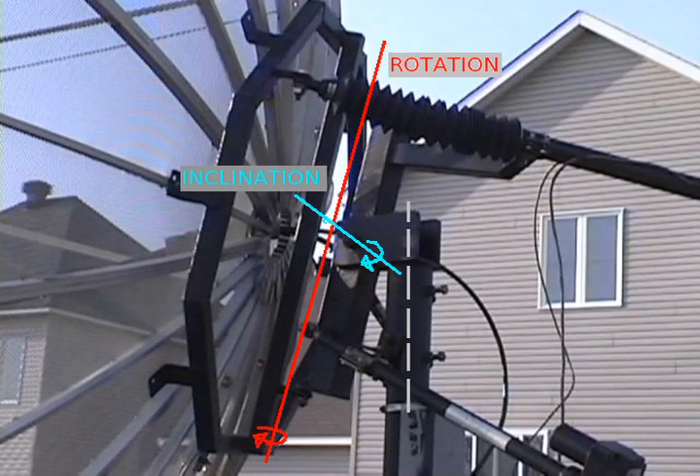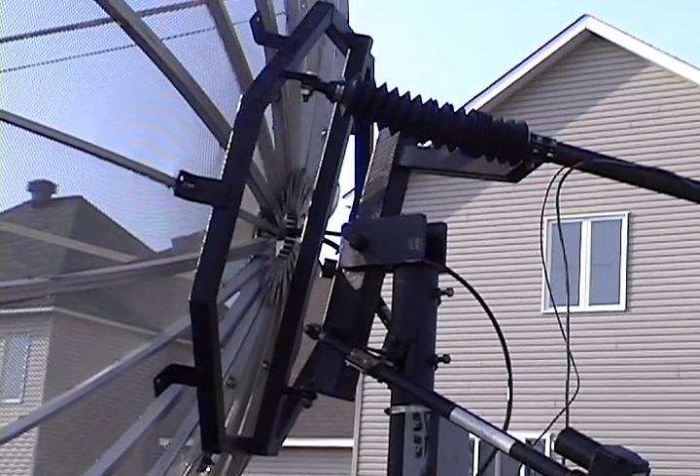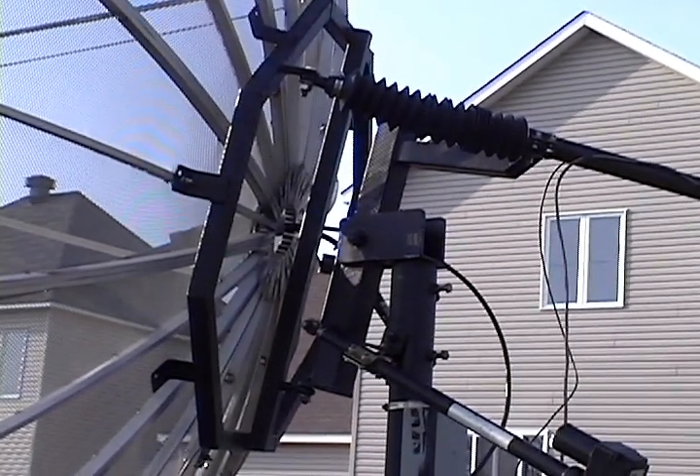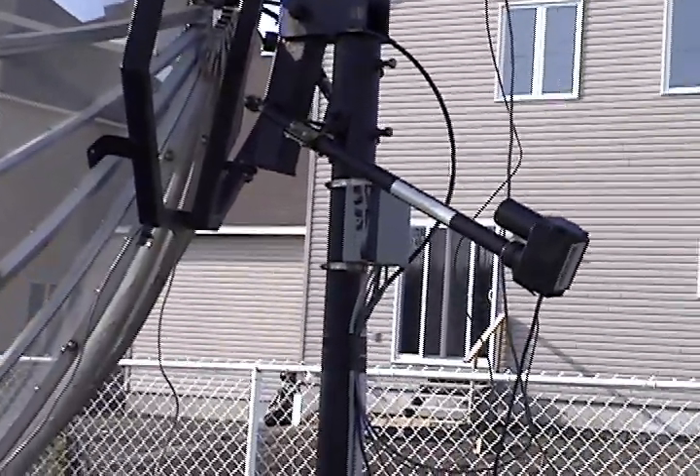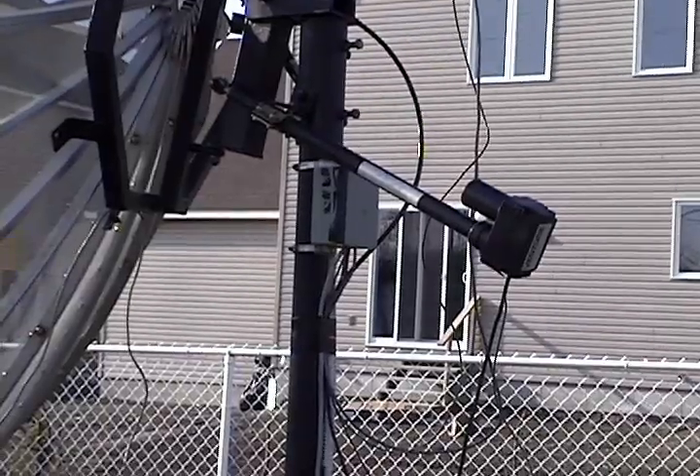The main difference is that it is the elevation axis that is referenced to the mast. To make things less confusing, I call the two tracking axes inclination and rotation, as shown here in blue and red. This makes the standard azimuth-elevation data provided by tracking software unusable without applying some math to it, something I do in my customized control software.